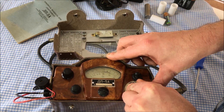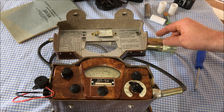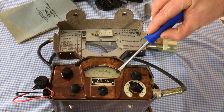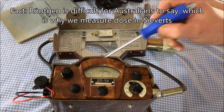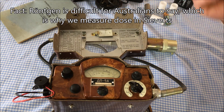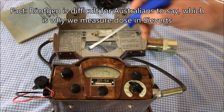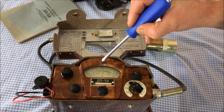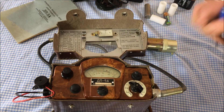The first setting with the number 200 is for making measurements from the high-range Geiger tube, using the scale along the bottom which goes from 0 to 200 in units of röntgens per hour. That's a particularly high range — you won't measure anything like that unless you're in a seriously troubled area or measuring very close to an active source. Most of the time you'll use the top scale, which goes from 0 to 5 milliröntgens per hour, multiplied by whichever factor you've dialed up.